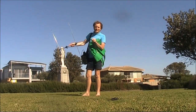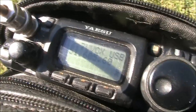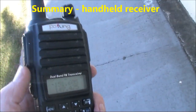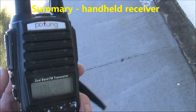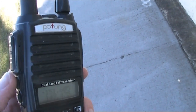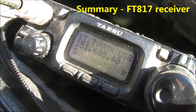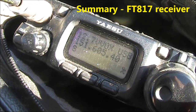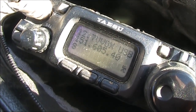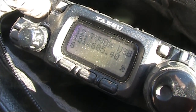On SSB, it's still a good signal. To summarize: with the handheld receiver and standard antenna, it has a range of about a kilometre, with signals pretty much gone by 1.5 kilometres. Given the strength of the signal at 2.5 kilometres, you'd almost certainly be able to hear it with this setup at 5, and possibly at 10 kilometres. Not bad for a few milliwatts, just above 2 metres.